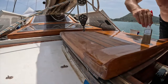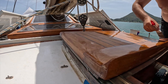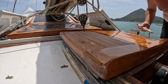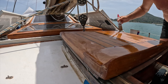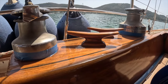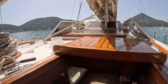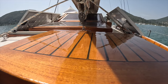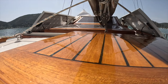I've taken a slightly different approach this time. I've taken the varnish off completely, then put on at least four coats of West System Epoxy to soak into the wood. But West System Epoxy is not UV stable, so I'm now adding at least four more layers of varnish to provide UV protection. So far it's not too bad — I think the finish is as good as it's ever been. We just need to see how long it lasts. The varnish is Epiphanes, and I've used it before and maybe only got two seasons out of it, so I'm hoping to get a bit longer with this one.